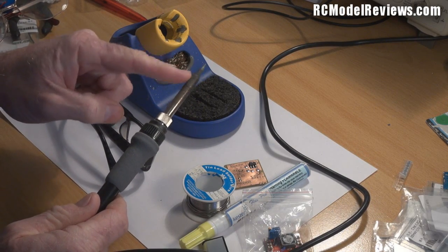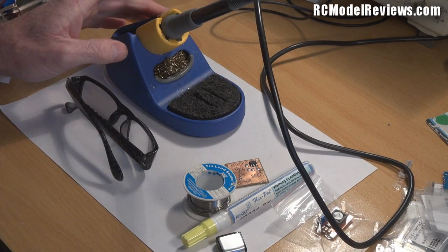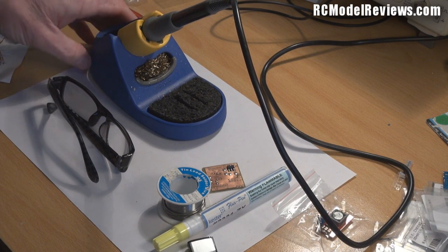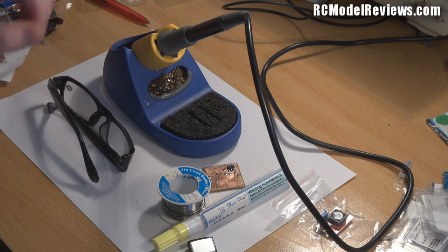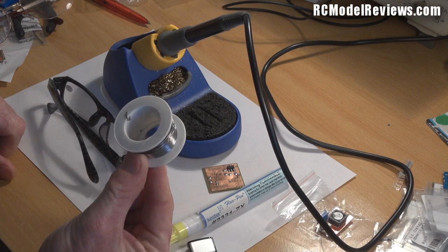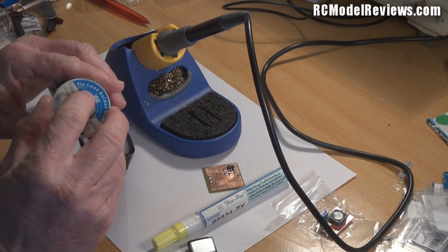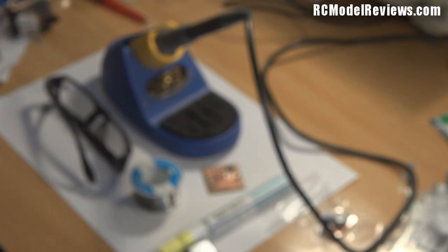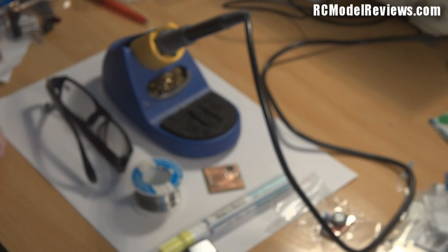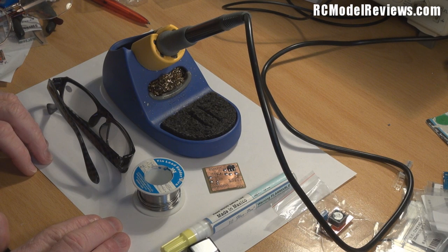This is about the best you can get. There are of course cheaper soldering iron options — the little 35 or 25 watt irons from the local hardware store. They'll work, but one downside is that they're not temperature controlled. And another key thing: don't turn into a hippie and get lead-free solder. Look for this magic word — 'lead.' You've got to have lead in your solder, otherwise you're not going to get very good results. Lead-free solder is designed to appease environmentalists, not people who actually want to build stuff that works.